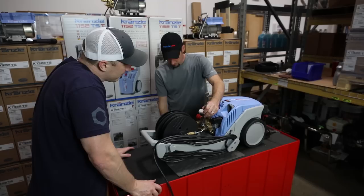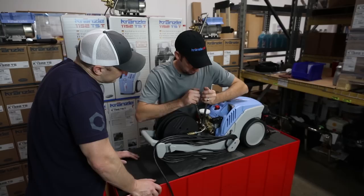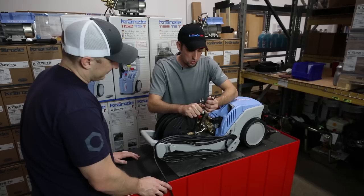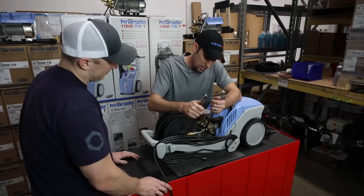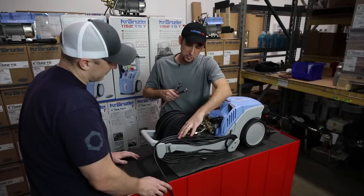To remove the hose reel we'll need a 17mm for one side of the collar on the compression fitting and a 19mm for the other. I usually only like to break it loose from one side. This area commonly comes loose in shipping, so sometimes you just need to reseat it. It's always wise to have two wrenches — you don't want to just turn on the compression fitting itself, because it may loosen up from the pump housing or from the chemical injector.